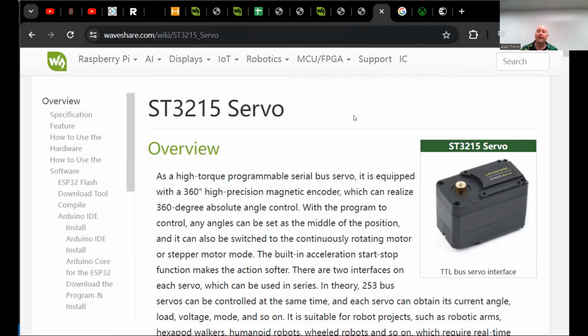Yeah, absolutely. The vendor provides an Arduino library for control through an Arduino or any type of low-level device. And that's what I'm writing for the brainstem portion right now, because they're run by ESP32s. For the purposes of today's demo, I have the board plugged into a Windows computer, and we're just going to do a Hello World equivalent application in Python, just to show how it works. But yeah, it's fully supported. The library is not pre-compiled, and much like the Python library, I'm finding myself making changes and updates to extend the functionality once I get my footing. Don't worry about any of that. We're going to use all the standard functions for today.